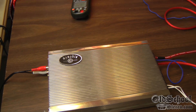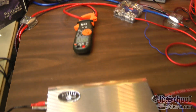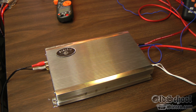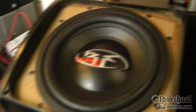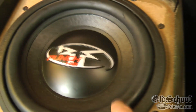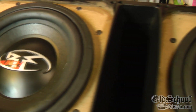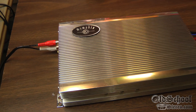What I'm going to do is a 2 ohm mono power output test and then I'm going to throw it up against these Rockford HX2s. Now, only one of these works — the other is sort of acting like a big passive radiator because it needs to be re-coned, both coils are detached. Let's check it out and see what she'll do. Rated at 500 watts at 2 ohms, let's see what kind of power she puts out.